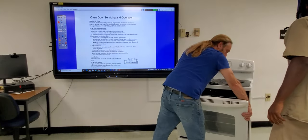The cooktop has two screws underneath it — this one has already been removed. You lift up the top to get to the surface elements; it is hinged. To get underneath, open the door, remove the two screws in the front, and you can access those surface elements.